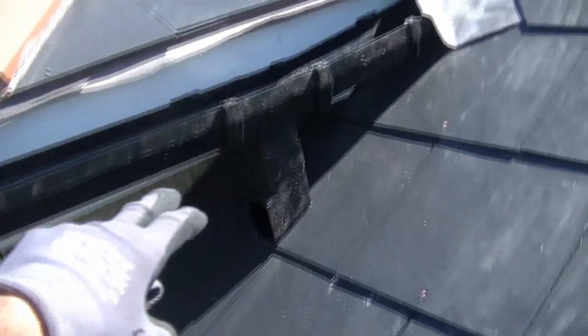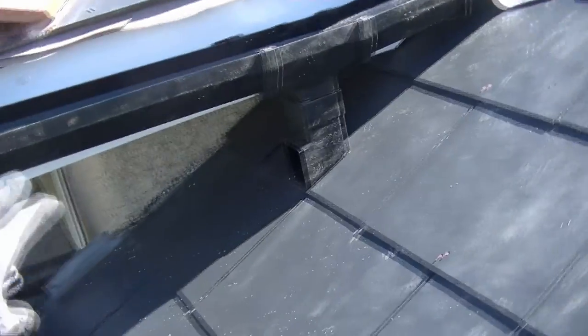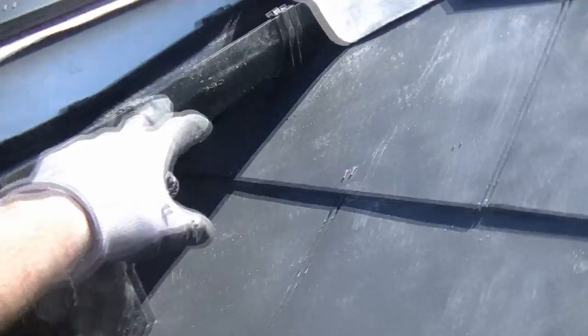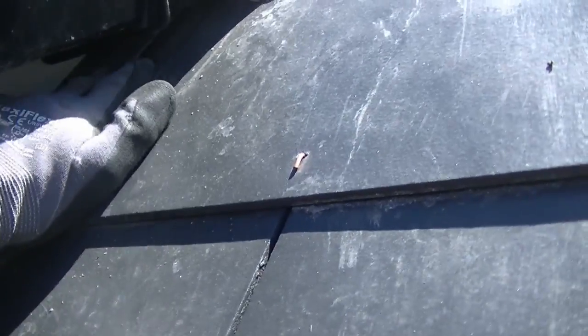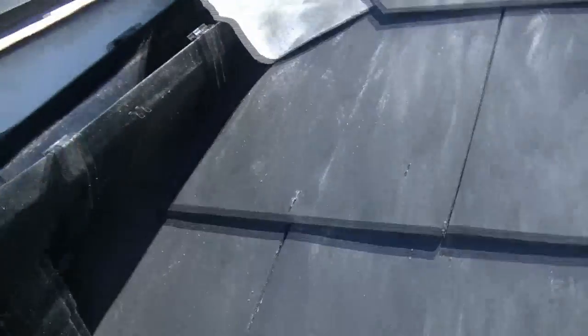Now that it's slated I'm able to put the fascia in and I've just finished off the gutter now. I've just done a little shoe there. Some people just drop these straight out the back over there but I thought it looked a bit neater. We've got the gutter sloping down there so the water runs off in this direction, not dumping it straight down on the slates. I just put like another lead soaker there - I wedged it up behind the fascia board and it just means if any water gets in there it throws it back out. We've obviously got this bit of lead coming over there as well so hopefully no water will actually get under there. This overhang should stay nice and dry.